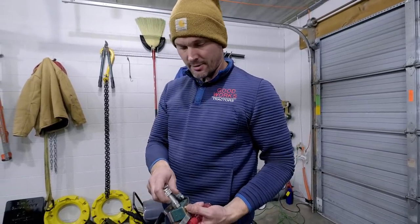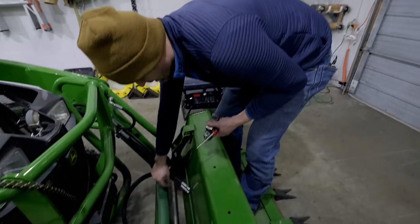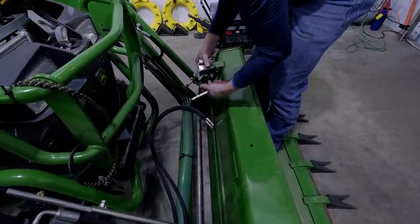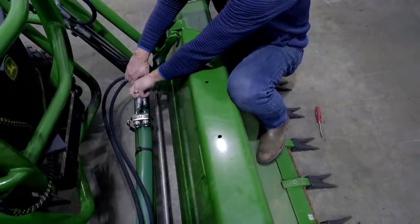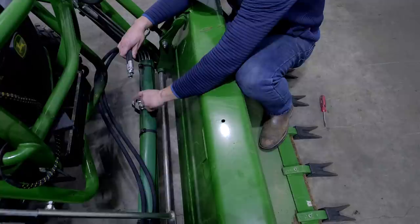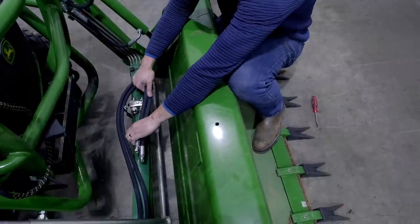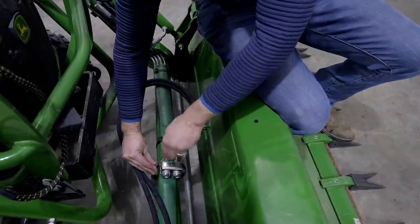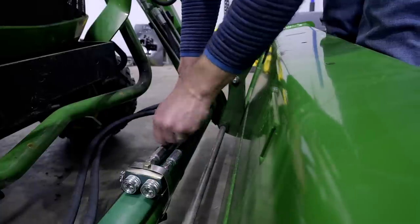The last hydraulic step, besides tightening everything down, is putting the connector up on the loader arm. Then you tie in the quick couplers on there — everything will be ready to hook up your grapple or hydraulic plow kit. I'm going to shift the hose position over to this side so the hoses are tighter with a zip tie and have less play. We'll give feedback to Summit — they're trying to custom-make these kits to fit individual tractors for a better fit, rather than a universal one-size-fits-all approach.